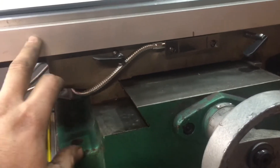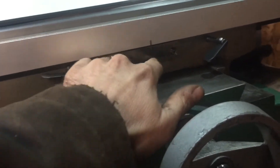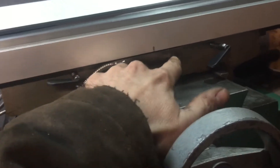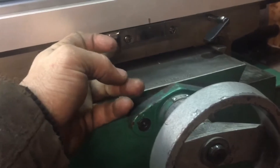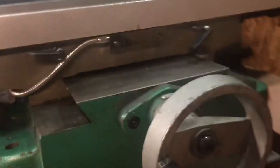There were two stops — they were inside the dovetail on the side, and then there was a piece right here. Unfortunately the holes didn't line up and they were too big, so I drilled and tapped two — I think these are 8-32 because they slide right through there — and then there are some shims in the back to keep it away.